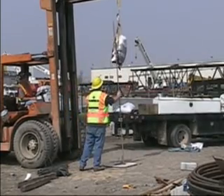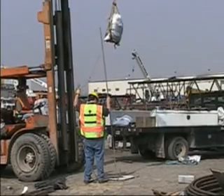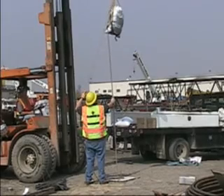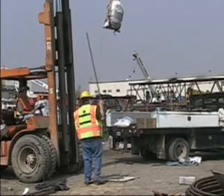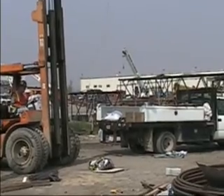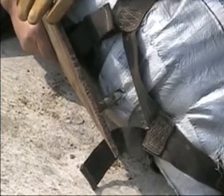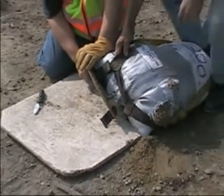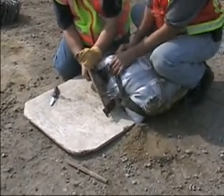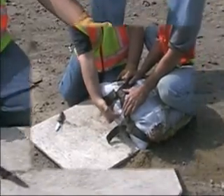We've reloaded a new sandbag because the first one split open. It's been weighed at 200 pounds, and we're elevating the bag to 10 feet above the ground. This is the impalement — you can see as I pull this out. Obviously these five-eighths inch, six-inch long anchor bolts are definite impalement hazards. If anybody says no, they're wrong, and these should definitely be capped or covered in some way. As I pull this out, we didn't have any blunt trauma — this thing just penetrated a good 2 inches.